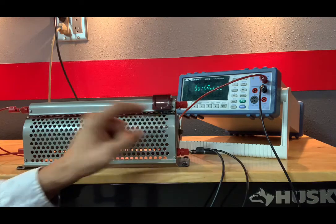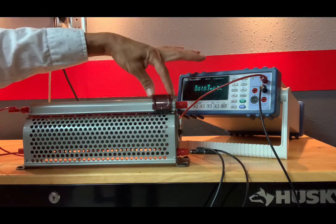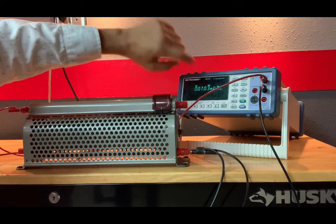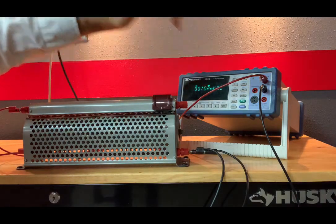Because the tick marks are spaced out at 1% intervals, you know that the error associated with this slider would be half that amount, or 0.5%. So write that in your table. The error is plus or minus 0.5 percent. And the output voltage will depend on what our reading is. Remember, the last digit of the reading on our digital voltmeter gives us the error associated with that measurement. It'll be plus or minus 5, the 5 being in whatever place that last digit is in.